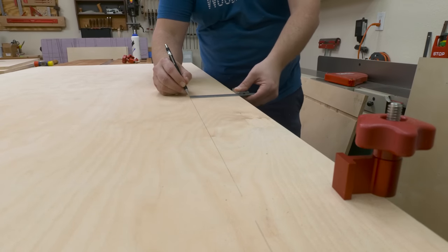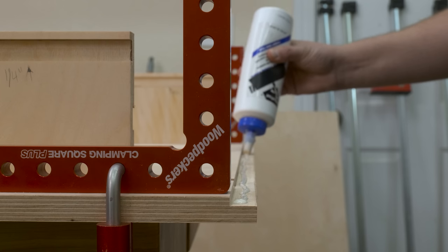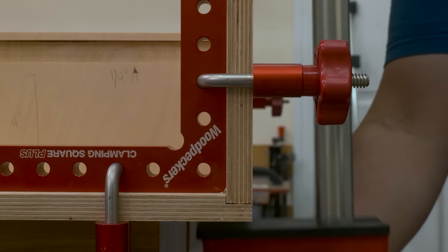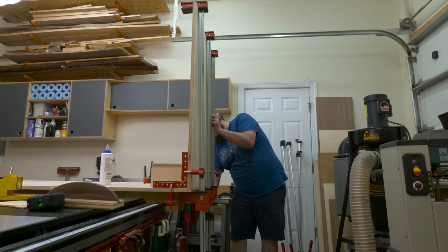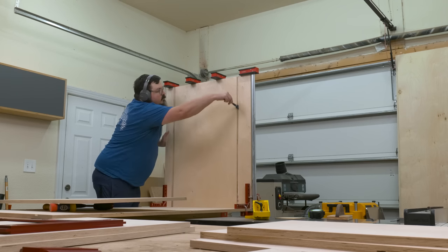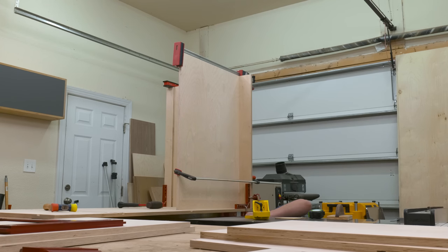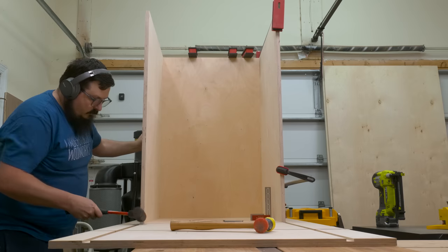Next it was time to assemble this case. I first laid out some lines so I know where the center of my rabbets and dados are, so I can use some brad nails and glue to hold everything together. I also attached some squares to my first panel to ensure I had a good start. For the glue on this one, I'm going to use something with a long open time and working time so that I have plenty of time to put everything together — with a case glue-up this large, there's a lot of clamps and different parts to check. Once I had my first piece attached with clamps and I was confident everything was square, I drove in some brad nails and worked my way through the panels from top to bottom. This is where choosing your adhesive is pretty important, because you don't want to get halfway through the assembly only to find out that things are already tacking up. I'll leave a link in the description for the glue I use.